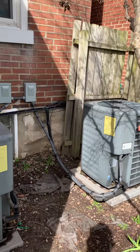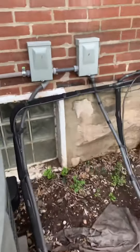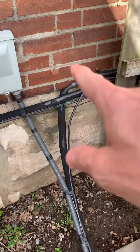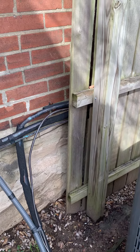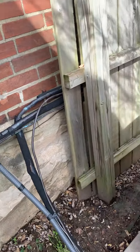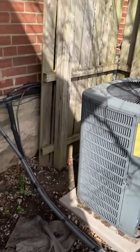There's the disconnect for this one. I do need to take a closer look at the breaker panel. These line sets moved to the back — they used to be on the side of the house. The line set on one of them is kinked right there, so maybe look at rerouting the copper up through here. It's probably finished in the basement though, so we'll see what we can do. Obviously need new armiflex, and probably spin these so the line set is just coming in the back — don't need to wrap around like this, just bring them out a little further.